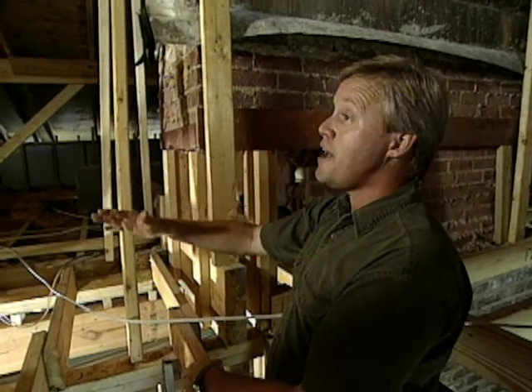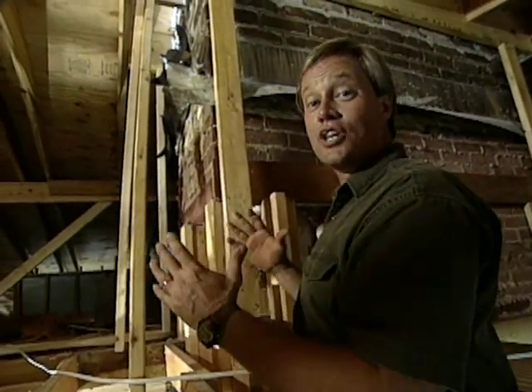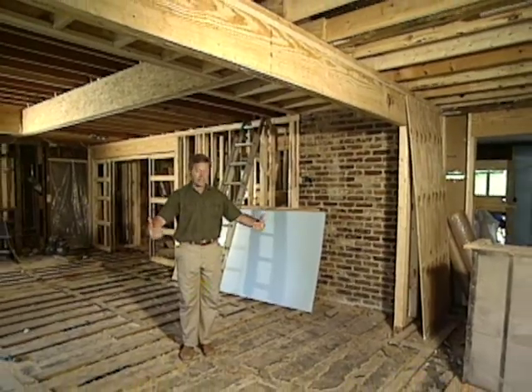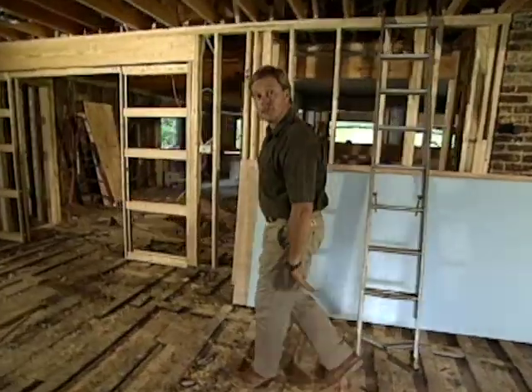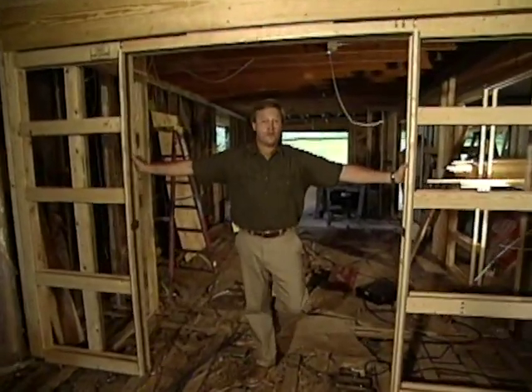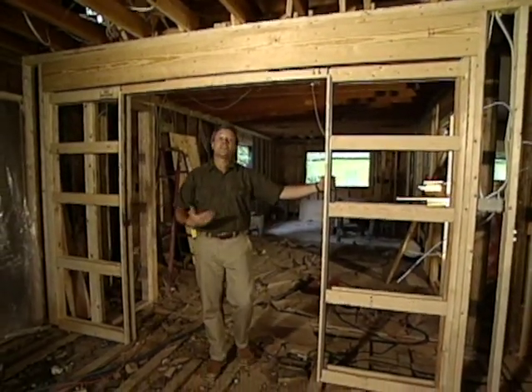You may ask why we didn't just remove half of the chimney instead of going through all of this. The reason is the proportion of the large chimney with the large roof section — it would look much better by continuing this large size instead of shrinking it down. Now to enhance a large room like this, it's great to have a nice wide opening leading into the room, just like the large cased opening coming in from the foyer. If you need a little privacy in a large opening, you can accomplish that with a double pocket door like we have on this side of the room, leading into a future kitchen. This is a five-foot opening, so your door is tucked back into the wall on each side, but you need to allow a lot of room in your framing for a pocket door frame like this because it requires an 11-foot header above it. A double frame like this in an existing room can cost as much as $2,000 for materials and labor.